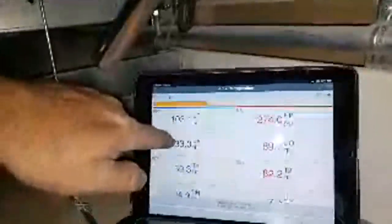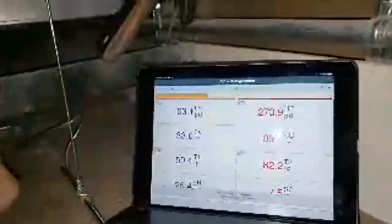We go to the AC mode and see what the conversion factor is. Superheat and subcooling aren't going to count because that's water temperatures off those probes. But you can see that the coil is running at 33 degrees, and 89 — so it seems to be plenty happy.